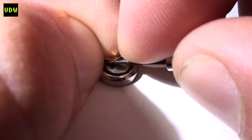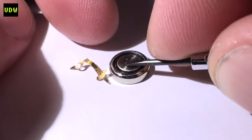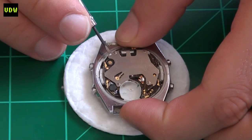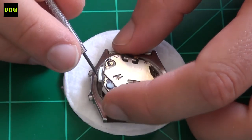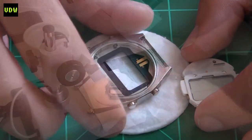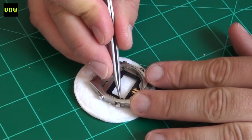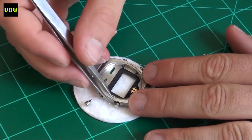This conductive pad was going to be used on the new power cell, and I wasn't going to solder it on because I didn't know what the heat could do to it. Next I removed the module from the case. My advice is always test the module first to make sure it works before doing any work on the case — you don't want to spend four hours on the case only to find the module doesn't work. In my case I applied 1.5 volts and it lit up, so I immediately started working on the case.